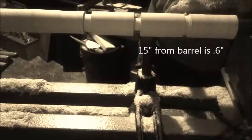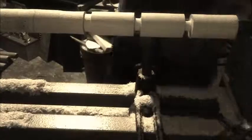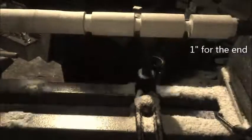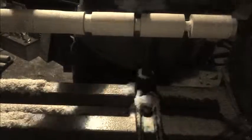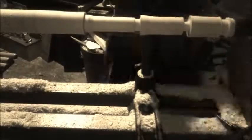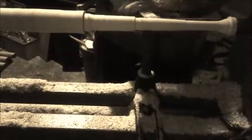At the fifteen-inch mark you go to point six — that's the thinnest part, that's the handle. And then for the tip, you leave that at one inch. After you've got all those down to where you want them, you can just start taking away some wood and bring it down. I do recommend leaving all of your measurements a little bit over — maybe a tenth of an inch over for final sanding, which will bring it down to the desired measurement.